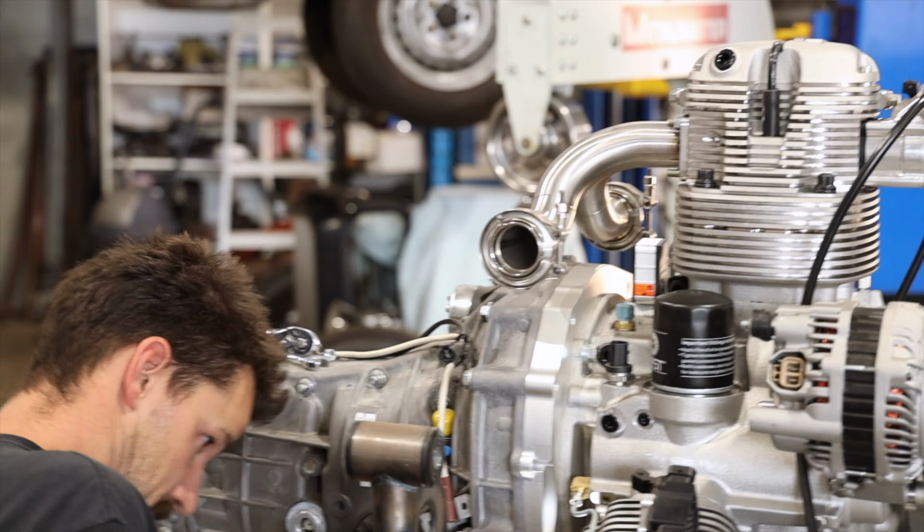So I'm going to leave the video there. In the next one, we will take all this off, back purge, and fully weld it all. I still need to make some mounts, really neat low profile mounts that will keep all these together. You definitely want that back bumper to be nice and parallel with really nice lines, and a few tailpipes are off by a little bit. So before I remove this jig, I will run a little mount across there, and then everything can be removed for final welding.